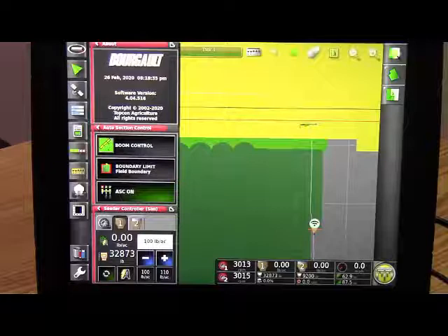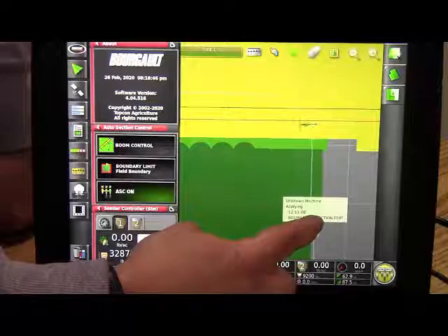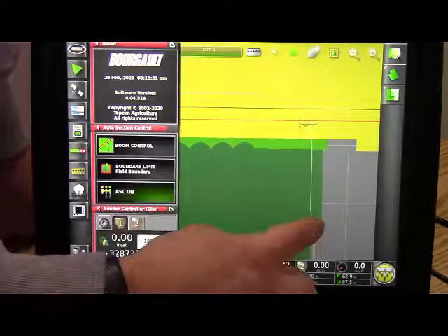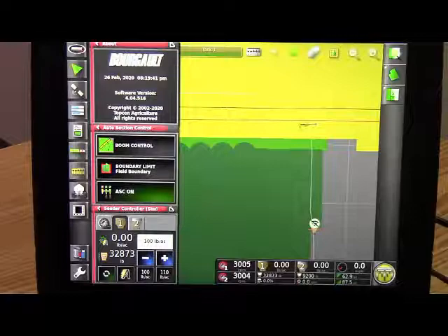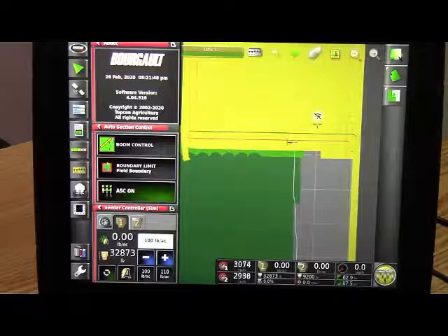The vehicle implement icon shows a connection status symbol for each remote machine. When connected, you'll see the icon without any line through it — if you touch and hold it, it will give you information about that machine, the products it's applying, and the name of the machine. When not connected, you'll see a line through the bubble, and pressing it will show the information but indicate 'not connected.' This means you're either out of range of the antenna or have lost connection to the CL55. When out of range or disconnected, the other implement is still recording coverage, and when connection is restored, the bubble's line is removed and the highlighted coverage from the other machine is updated onto this monitor.